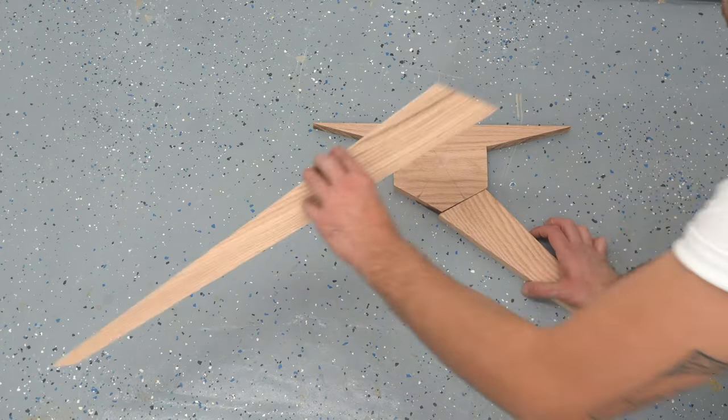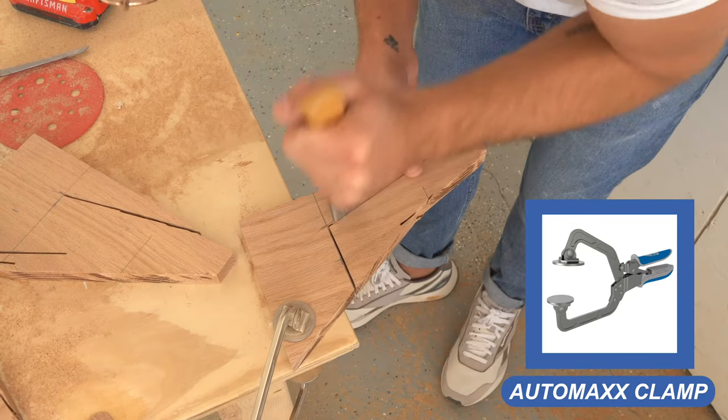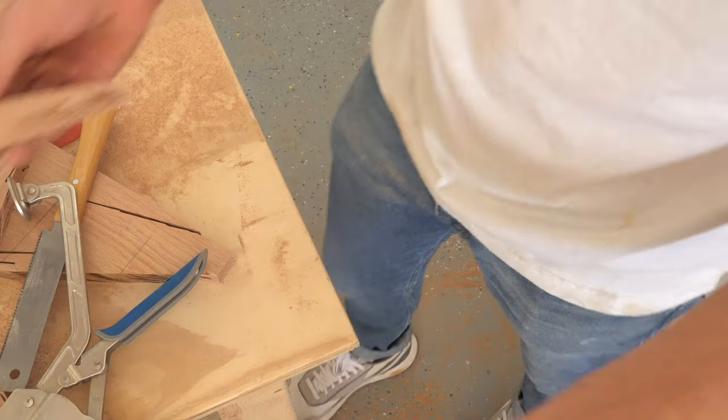The big piece for the hub connects to the long leg in front and the back leg. For the two side legs, the hub piece is basically cut in half and I'll pocket hole that in the center. You can see how everything will come together here.